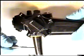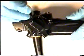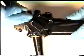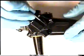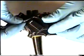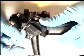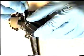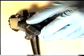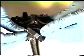First step, using your number 2 screwdriver, is to remove the left-right free lock knob trim ring. 90% of the time this ring will break due to the fact that it is glued in with black RTV, so it will need to be replaced.